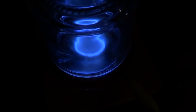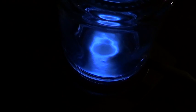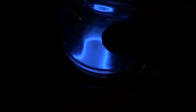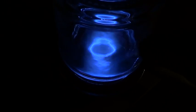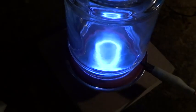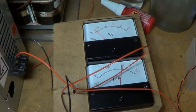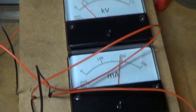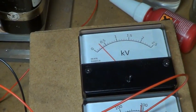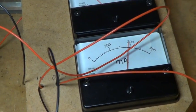The discharge is confined to a perfect ring on the base. The current has been up to about 200 milliamps and the voltage has dropped to maybe 300 volts, so the resistance has dropped drastically.